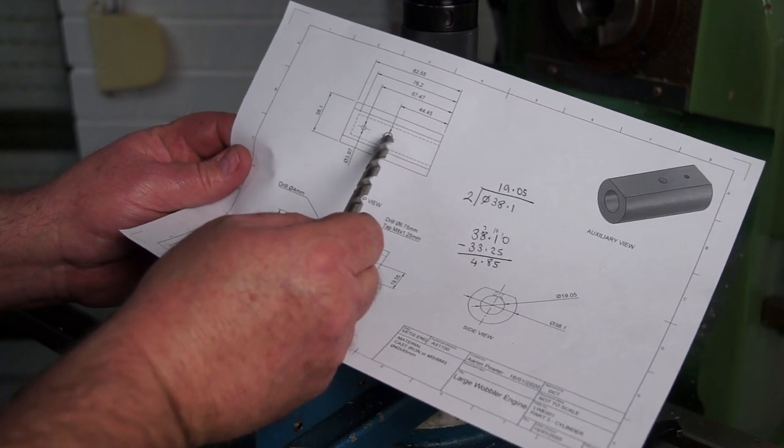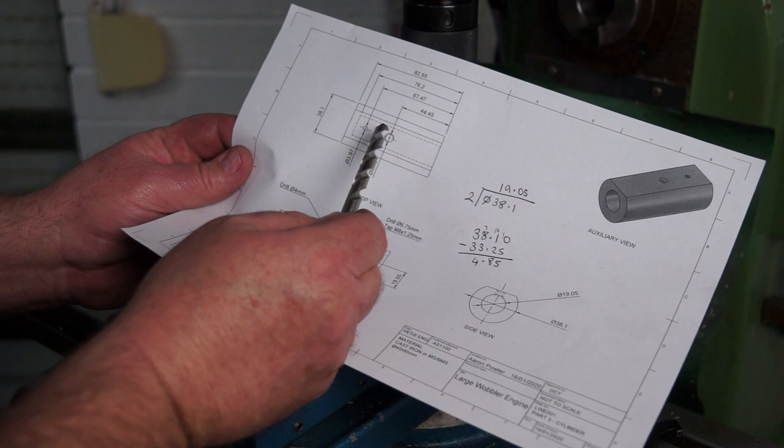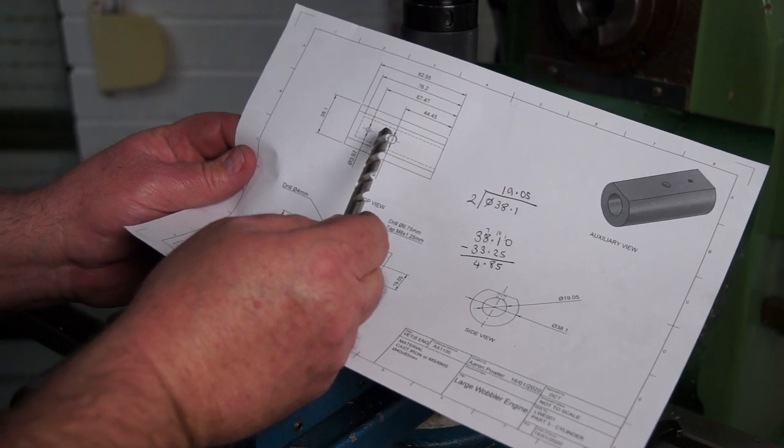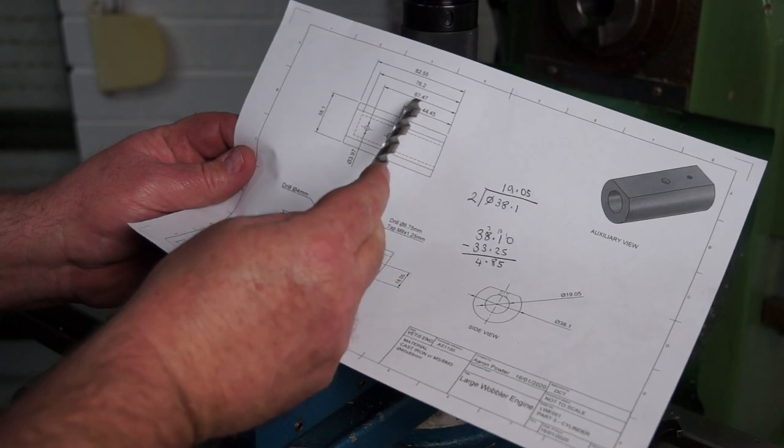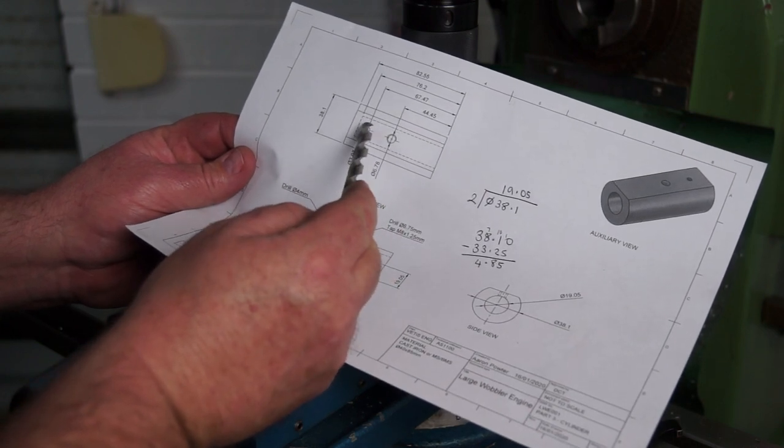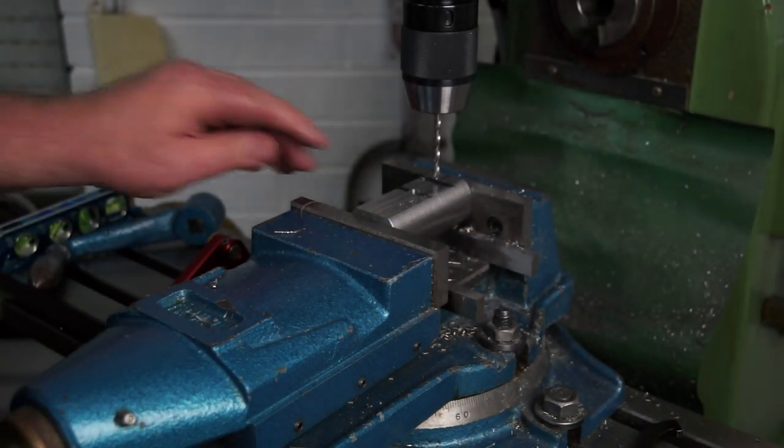I was going to drill and tap that, but we have been having success by using just red Loctite and Loctiting it in. It's just a pivot location. Now I've come up 67.47 to pop in there and drill that hole, and I know I'm on my mark.